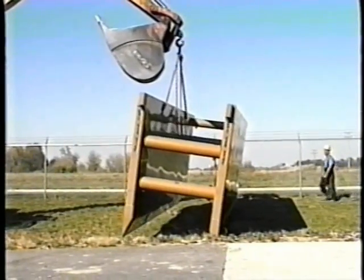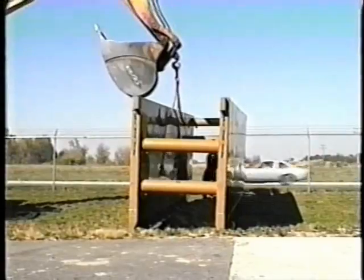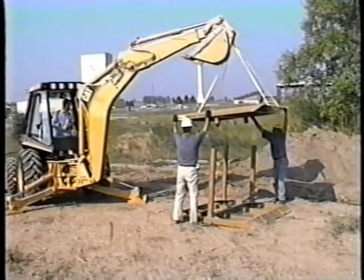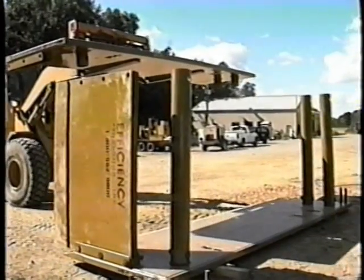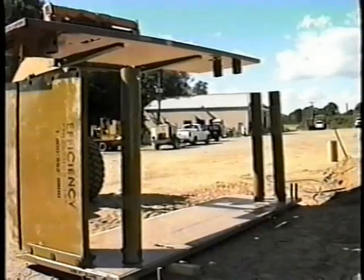This pin and keeper system cuts assembly time to a minimum, usually 15 minutes or less. This same procedure can be used with smaller trench shields using lighter equipment such as a rubber-tired backhoe. In addition, this same procedure can also be used to assemble trench shields by using a forklift or front-end loader with forks that attach to the bucket.